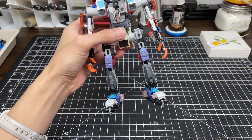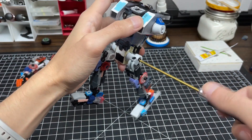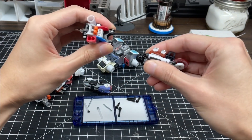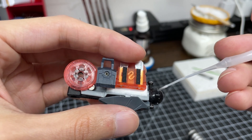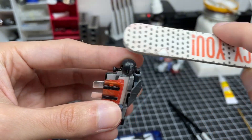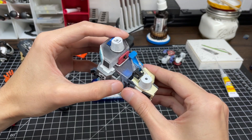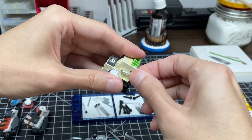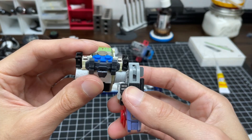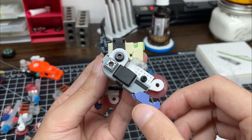Before finishing the surfaces, it's time to finally address those weak ankles. The entire mech needed to be disassembled for finishing, so I went ahead and fully broke down the legs. I'm moving forward with the repeated suggestion of adding a thin layer of material to the ball of the joint — this will decrease tolerance when fitted to the socket. Mounting the ball 90 degrees from its current orientation may have avoided the issues, but this solution worked in the end. While disassembling the rest of the machine, I found the hips had lost range of motion after adding new mechanisms; a quick conduit reroute solved the issue.